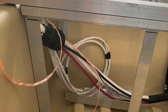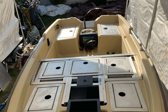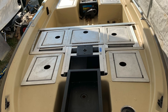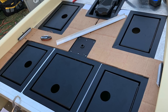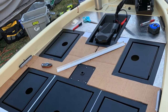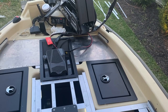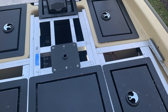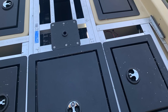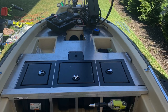The frame is actually 1/16th inch thick angled aluminum, inch and a half by inch and a half. They sell kits for these specifically so you can modify small boats like this with aluminum. Based off Sebastian's measurements, he handpicked his own size of drop-in lids, powder coated black before they arrived. He templated the gaps between hatches with cardboard and used that exact cardboard template to cut out the aluminum sheets, and that's how he made the entire deck complete.